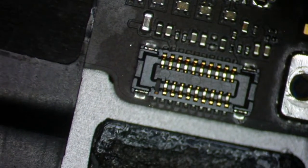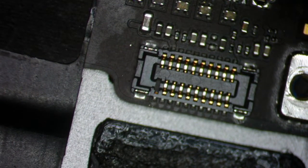The customer thought that he knocked out a component on the touchscreen connector. He was doing a repair and he's not getting any touch, so he sent it over. But once we got here we realized it's not a missing component like a resistor or anything like that — actually he bent a pin. So he is missing that left pin on the connector. You see how you have the little gold things and then suddenly there's nothing.